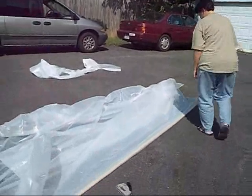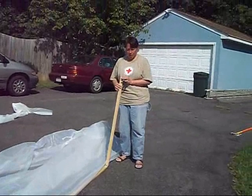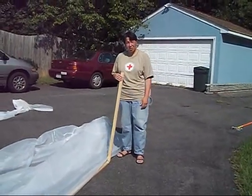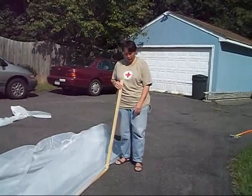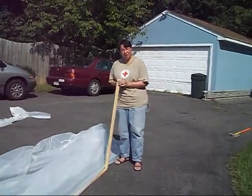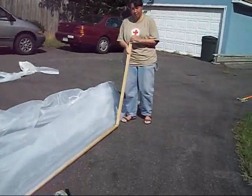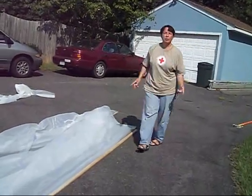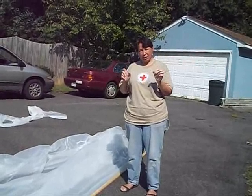You can use something else. I've just used 1x2 — it's like a dollar for an 8-foot length. You could use 2x2, or you could use that conduit tubing if you wanted. But I like this because it's got a flat edge that I can screw into easily. I've put a tiny little joint there at the bottom, so this is now just a little bit under 12 feet long. The reason I want it a little bit shorter than 12 feet is I actually don't want it going all the way to the two edge pieces — I want to fasten it on all the intermediary pieces.